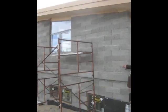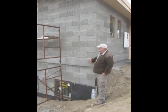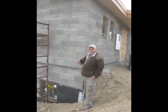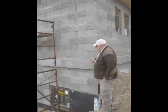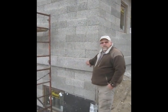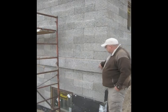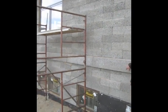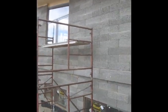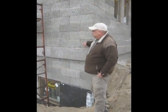We have a FastWall block that's been filled with the pea gravel mix for the wall. What we did was we used the flat panel that FastWall offers, and we adhered it to the block with some spray foam called Enerfoam. Then we attached it with some screws — a Torx star drive screw — and put sort of a belly band around the building.